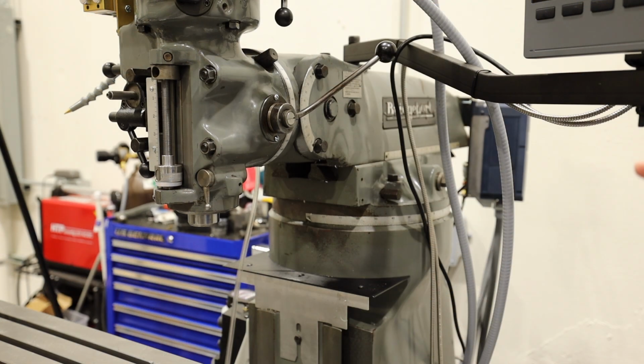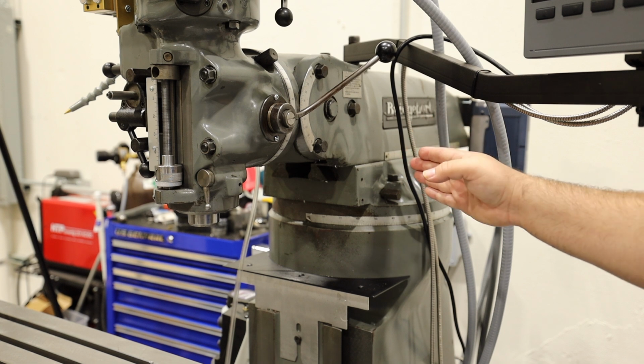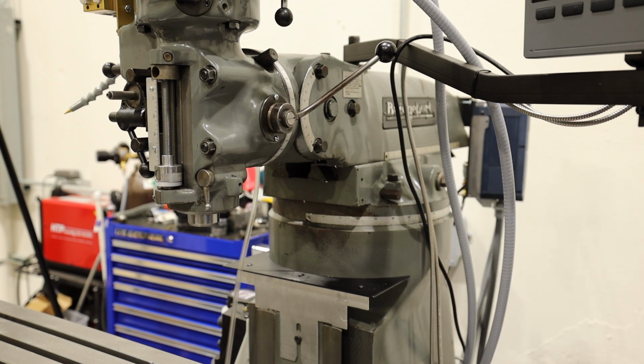should be fine. So even before we get to spindle tolerances and loads, we want to just have a quick look at our setup. We want to make sure that the head is as far back as it'll go for the particular job we're doing. The closer we are to the column, the more rigid the setup. Going to make sure that all the bolts are secured, and we're going to make sure that the head is properly torqued down to the RAM.